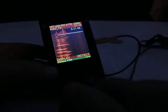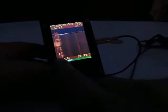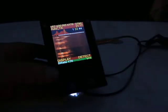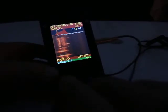Frequency I've seen; now sample rate. If I push the button I can change the sample rate. It can go quite high, up to 352 kHz, but then you only have signal visible on the left side of the screen and it passes quickly. I usually use a lower setting — 192 kHz is the one I normally use for live listening and viewing mode.